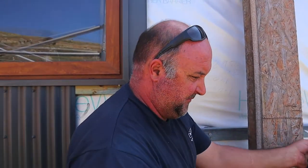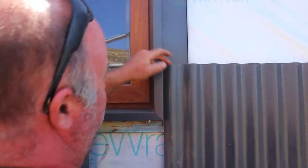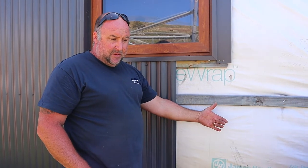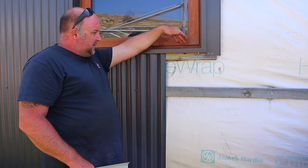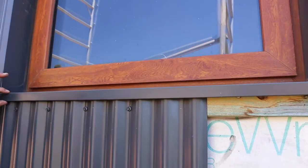It doesn't matter — it just runs down in behind the sheet. This is all waterproof. It's meant to be open for airflow and to release moisture because it does get condensation. Now the bottom flashing is the same profile where the window is — that 15 by 15 bend — but this one has been different on the front, so it allows the sheet to go up in behind. And that way we can keep that same 30mm profile all the way around.